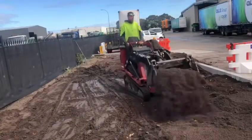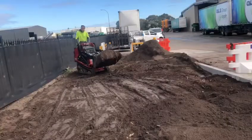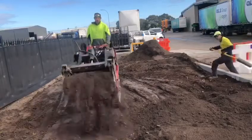With our backfill laid and graded, we add a top layer of black dirt. We keep this layer thin and consistent. Too much topsoil in any one area can hold on to moisture and result in root rot.